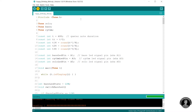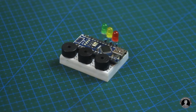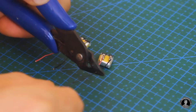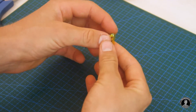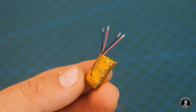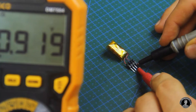After hitting Upload, the device should start playing the well-known Happy Birthday melody. This birthday melody music player wouldn't be complete or portable without its own little battery pack. Taking two of these 50 milliamp-hour, 3.7-volt LiPo cells, let's solder a pair of wires to each and tape them together with strips of Kapton tape. These will be connected in series to achieve a voltage higher than the Arduino's 6-volt minimum input, then we'll trim and strip the ends of the wires.